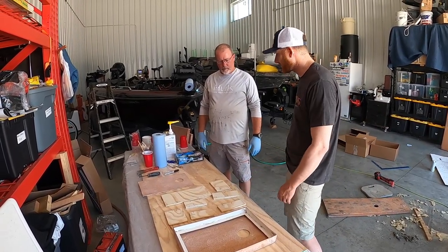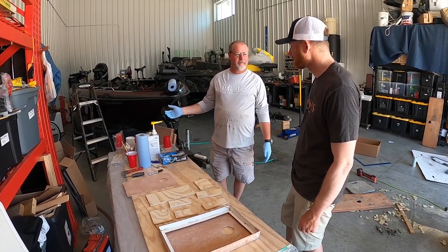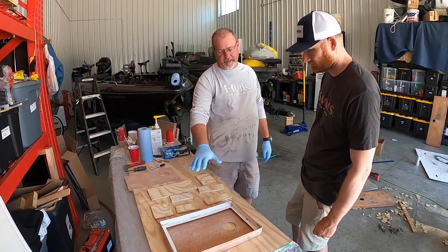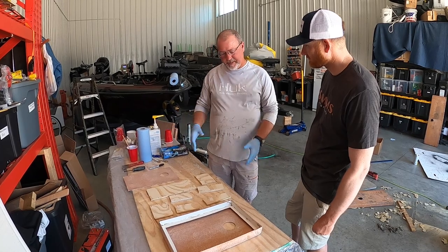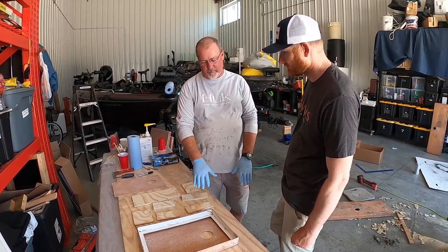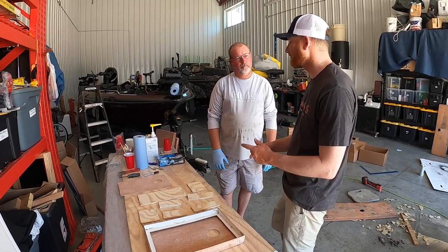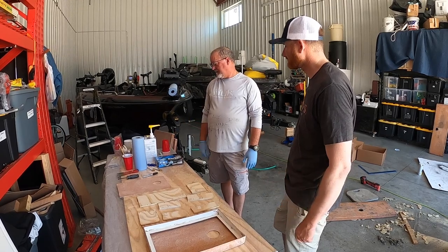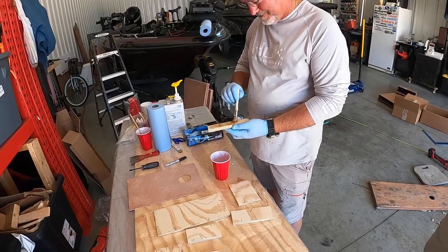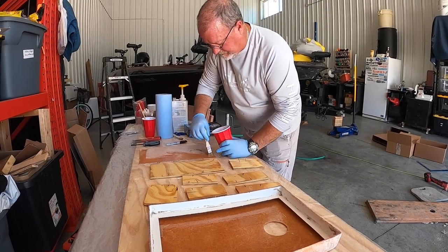All right, Captain, we've got the pieces cut — now we're just going to epoxy those in place. We're going to use our West System epoxy. That's what I like to use; there's a bunch of different epoxies out there, it just works good for me. It's like a jigsaw puzzle — all the little pieces of wood that are going to go in here. We'll wet everything out, slap it all together, put a little additive to make it thick to fill in the cracks and the joints. The epoxy we're using has a hardener that's five to one — and this is a fast hardener. They make really slow hardeners if it's really hot out, which creates a longer pot life. We'll mix it up in smaller batches, painted on — and rubber gloves, because it's messy.